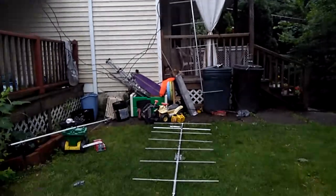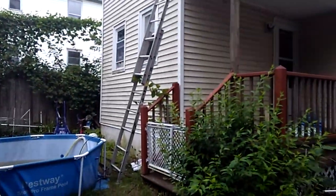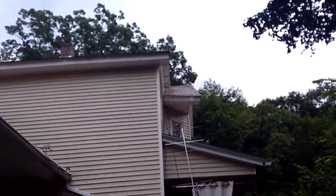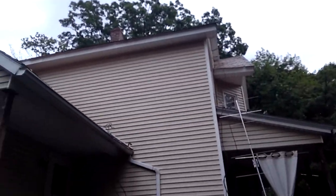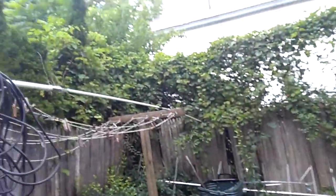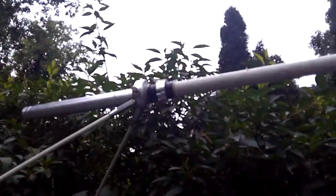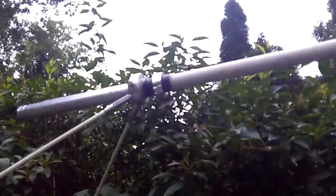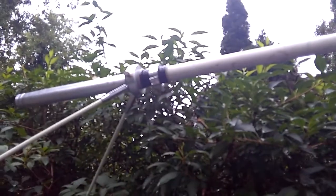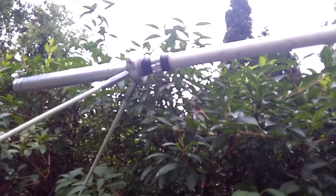So when I come back next time — oh, this yard is such a mess — I will have the TV stuff hooked up first. Going back up in the attic to do that. When I did the SWR, I had a fellow ham friend come over and check it with his MFJ analyzer. He said you could just move the rings up just a pinch to make it center on channel 20. So when I took it down, I did do that — just a pinch.